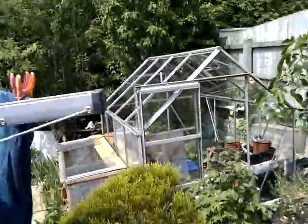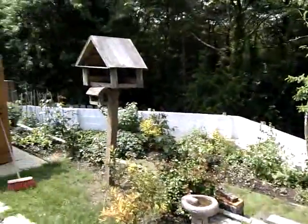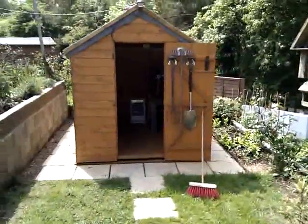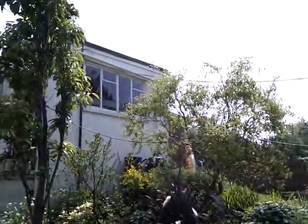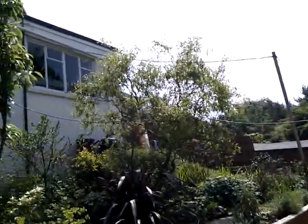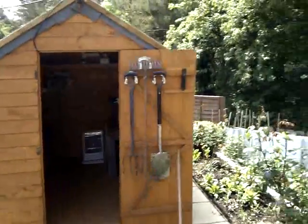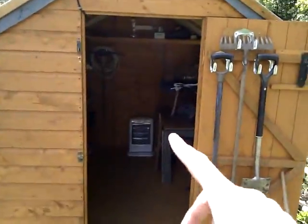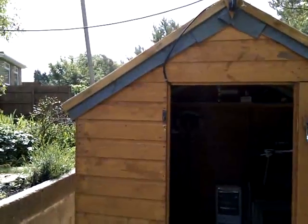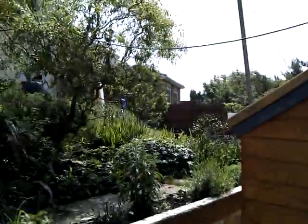This wire is just coming out of the conservatory, along the garage and down into the shed. We haven't changed anything technically yet - I'm going to be saving up. The very next thing we're going to buy is a bigger inverter for the shed so my dad can run his lawnmower off it. And then I'm also going to be buying a grid tie inverter, so on a day like today where we're generating more power than we're using, we can put it back into the house electric. It's going to be a hybrid solution - a big inverter down here for the lawnmower, and a bypass circuit to plug the solar setup straight into the house to use up excess power.